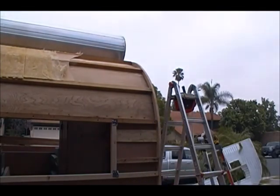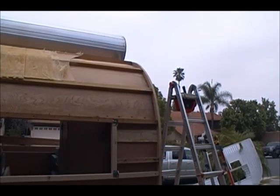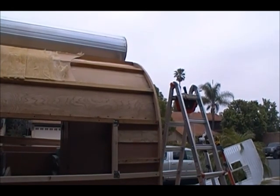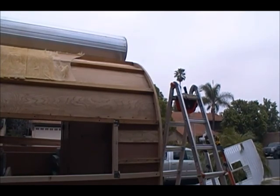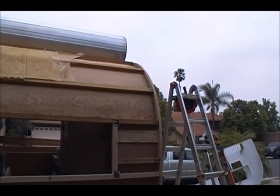Okay, so you saw me take off the old, put on the new, and it really didn't take that long. Now, I did have the pieces pre-cut, but I knew what the sizes were because I cut them for the other side, and they are identical: 1-inch wide strips cut across the grain on the plywood. There's only 3 ply, so the center ply in the plywood is going the long way. So all the ply on the outside and the ply that's face down is going cross cut. So that allows the plywood to bend.